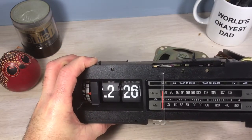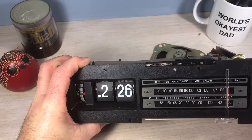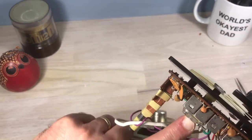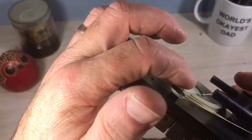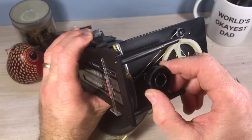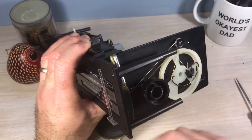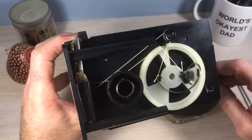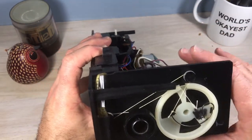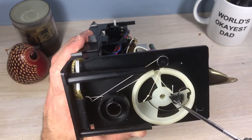We've got to take a look here and get a feel for what it's doing. That's the indicator — as you see, it's attached to the string, and that's the actual tuner on the circuit board. That's what tunes in the radio, and that is attached to this big wheel here. This knob here is kind of loose and it's only held there by tension of the strings, and that's probably what happens — sometimes that can get off there and you're in trouble.